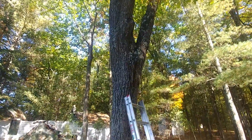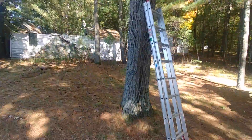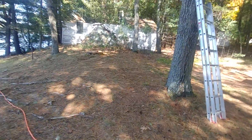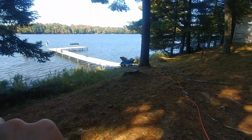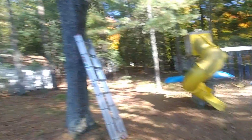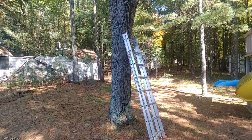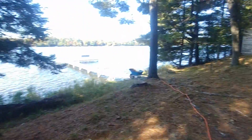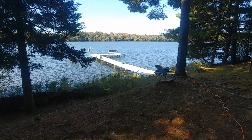We're going to go up to that crotch in the tree and put the pulley up there. At first, all the pulley is going to do is let me use just one pulley to change the direction of force — instead of pulling straight, it's going to let me change direction and put the car over here if I need the car to pull. It's not going to give me any mechanical advantage yet. Then we'll get the boat lift close to the shore and rearrange it to build our mechanical advantage pulley system.